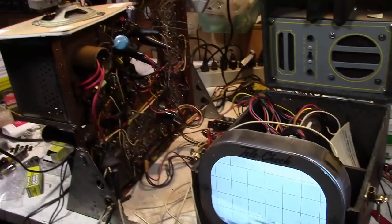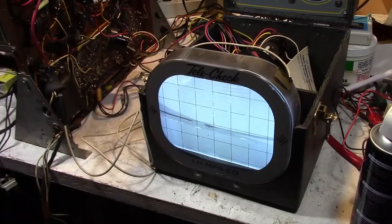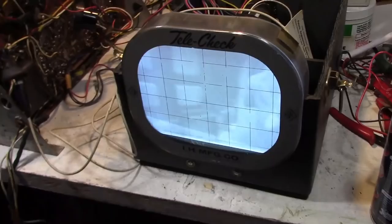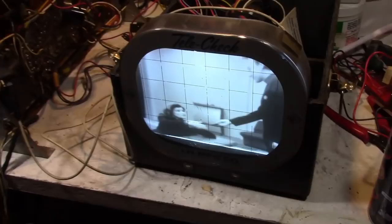So to finish the recap: check the resistors, check tubes, even swapped some tubes in the IF and tuner, because I'm just not happy with the performance of this set. It works, but as you can see, the vertical needs to be readjusted periodically as the set warms up, which gets annoying. Also, the picture is not as sharp as I'd like it to be, and I suspect the two may very well be related. I'm adjusting the contrast right now — all the controls do what they should: brightness, contrast, and so on. There's a local/distance switch which changes the gain. But check out this image, which is not that sharp.